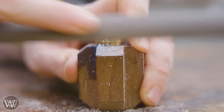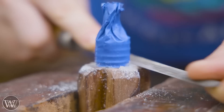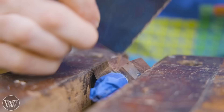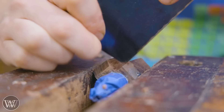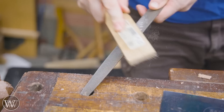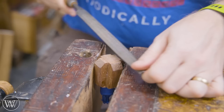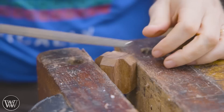I'm going to hit this mostly with files to do the cleanup. You can see where the epoxy squeezed out — the files make quick work of bringing it flush to the surface. To get right up close to the brass, I'm going to wrap it with tape so I'm not scuffing it with an accidental rub. Card scrapers are phenomenal for cleaning out glue — you can turn the card scraper and get right down into the corner and get a nice smooth surface. A good card scraper is an amazing thing for epoxy — it works so much faster than sanding, so much easier, and you can get into a lot of detailed spaces. One problem with files is they clog up, so make sure you're regularly cleaning them — having a good file card will allow you to clean them out quickly and easily.